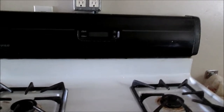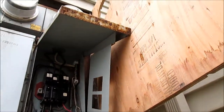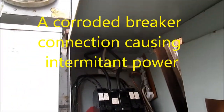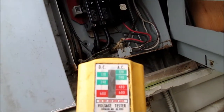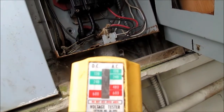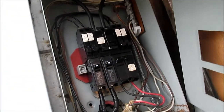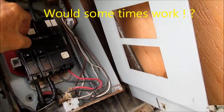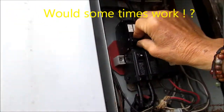Thank God we found it — easy out. Basically we didn't have to pull all those branch circuits off. This breaker here — I use this meter to test the draw on the system. It's not just a digital thing reading possibly static voltage; it will test a draw on these. This breaker right here is not working and it seems to be intact, but it's just not working.